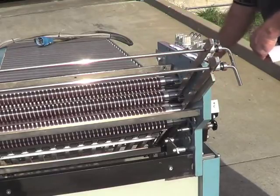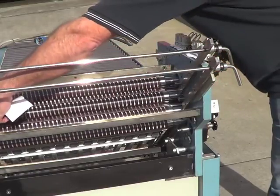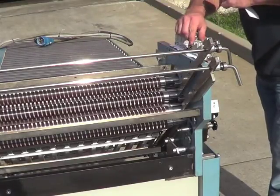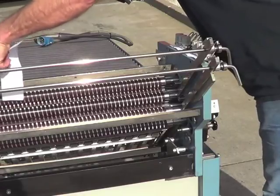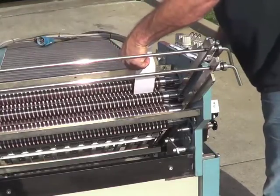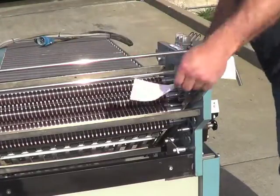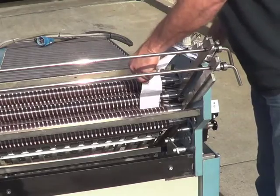Using the hand wheel to turn the rollers, roll your sheet of paper in there, then look for the drag on both sides of the roller. Light to medium drag on all of them. Going into gap number two, use the number two adjustment to check pressure. This side's a little looser, so go counter clockwise to give it a little more pressure. Now just a little too much pressure — so clockwise just a little bit until you get a nice even drag on both sides. Set all your rollers the same way, same tension in all the areas.